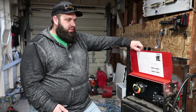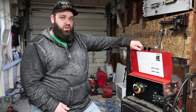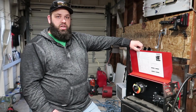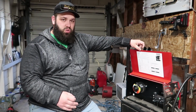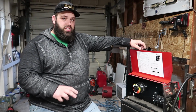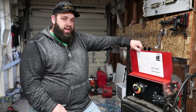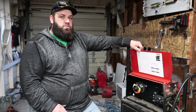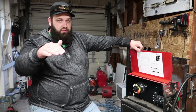If you're just welding together super thin, you know, 16 or 18 gauge, and that's all you ever use ever, maybe you're just building like a lattice thing for entryways or stuff like that, super thin, kind of artistic stuff, nothing structural ever. Perfect. If you ever have a need to build something structural, go at least one step higher than this, the Lincoln WELD PAK 140 or equivalent.